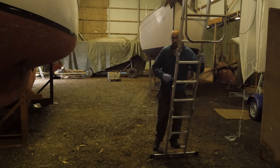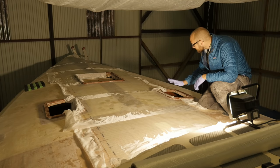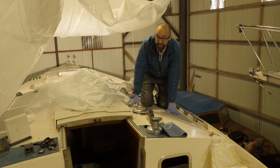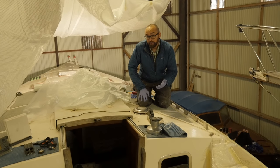Let's head up and see how that laminate from yesterday turned out. Well from up here it looks pretty good — there are some tiny bubbles but overall it looks pretty dang good. As for the plan for today, I think we're going to lay up two layers of 830 grams on one of the two sides. The reason I'm not entirely sure is because someone managed to take a tumble through that forward hatch yesterday and rack a pretty good amount of fiberglass, so I don't know if we've got enough fiberglass for today.